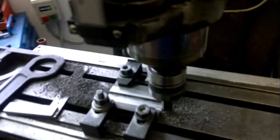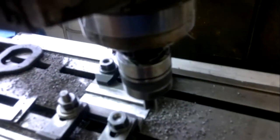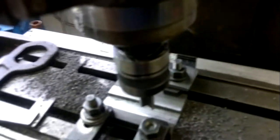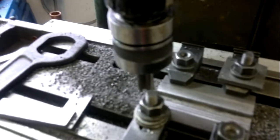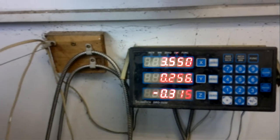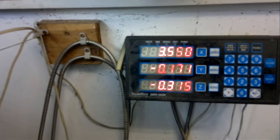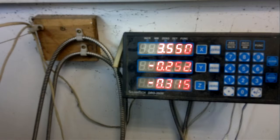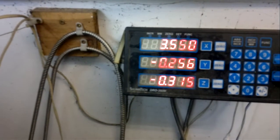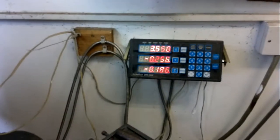Today we're cutting the slideways for the pump brackets and pump slideways that sit on the back of the engine. The first thing to do is set the cutters up away from the machine and wind back to the start. This is a three-quarter slot drill but it's slightly undersized, so our offset is 256 and a half thou. We've cut the first slot at 576, and now we set the dot on for 256 and a half and lock it off on the mill.